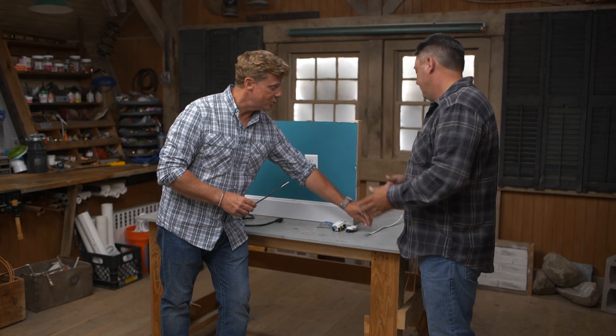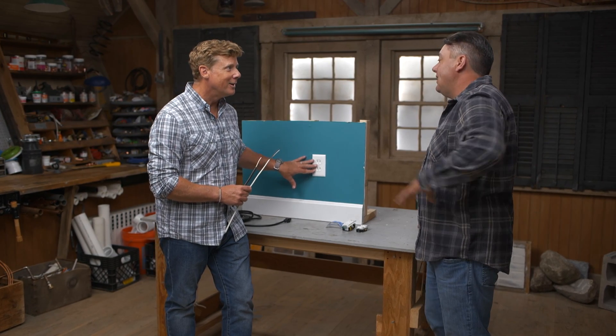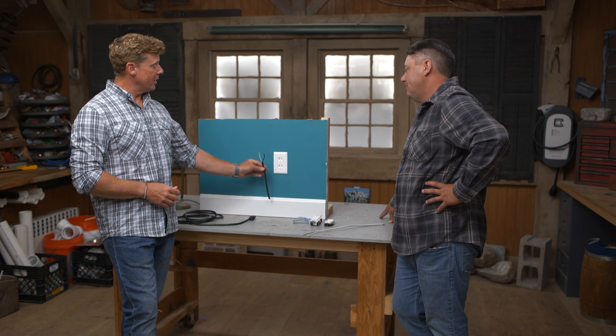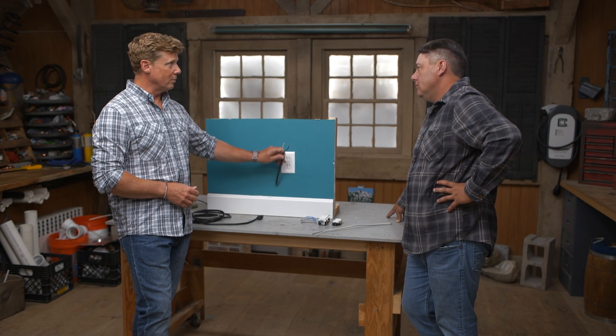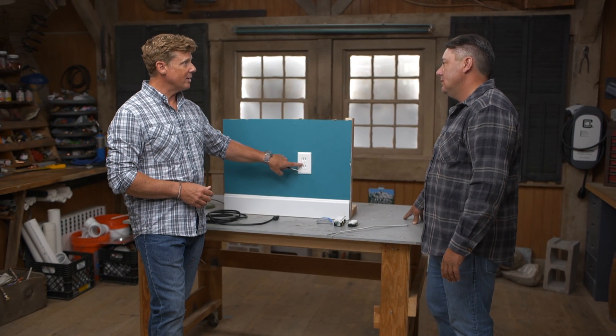In the alternative situation, if it had been plugged into a three-prong receptacle with the proper grounding conductor inside, you wouldn't be the path anymore. That is the path of least resistance. If everything is done correctly, current comes in, shorts out, goes right out, and trips the device. So that begs the question: if I have a two-prong receptacle, which suggests I have older wiring behind it, is this a safety risk?